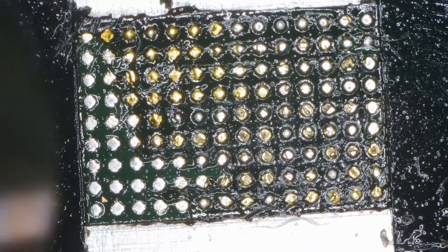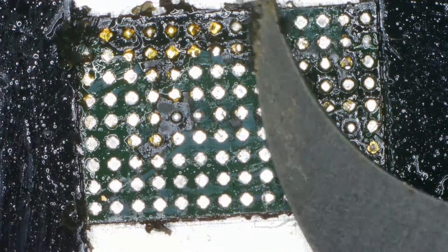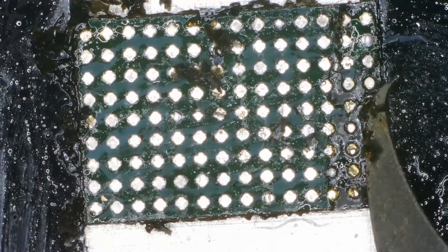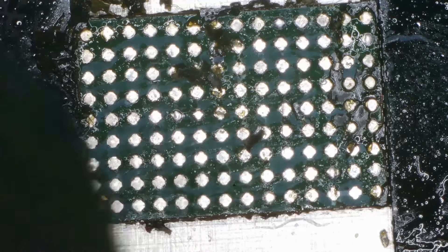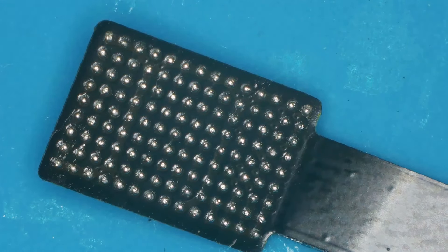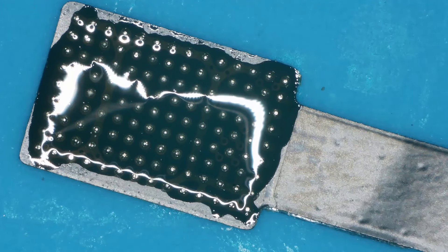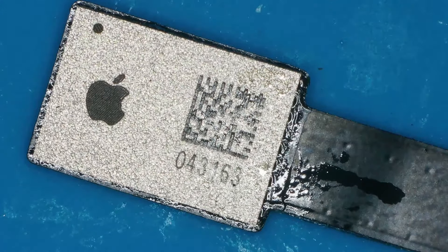I think there are only one or two pads I missed — that's really encouraging. You've got to be careful how hard you push when scraping because you could scrape the masking away, and if you do that it can quickly become game over. Taking it slow. I'm a bit concerned with the screen nearby, so I'll put a piece of paper over it for protection. A tiny drop of flux, maybe a slight bit too much — top left corner looks about as good as I can do.